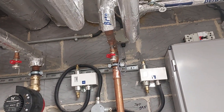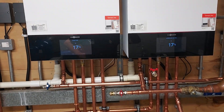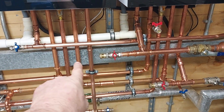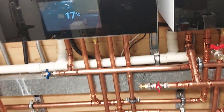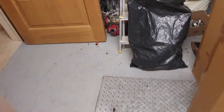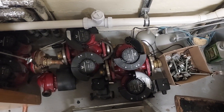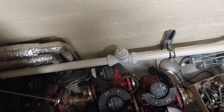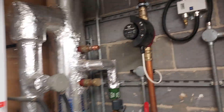This is a two massive commercial boilers setup. We had one of these pumps on each boiler — a 25-100 circulating from the boiler into the low-loss header — and then a twin-head 25-100. We've taken out a pile of pumps, two or three grand each — one, two, three, four, five pumps — and a couple from the underfloor heating.